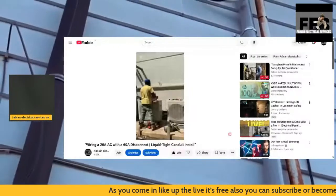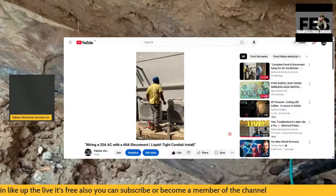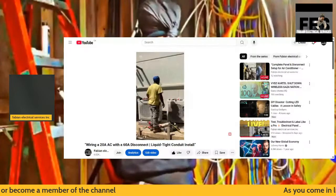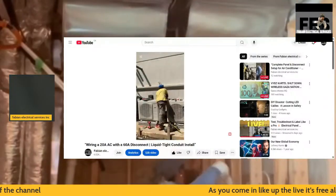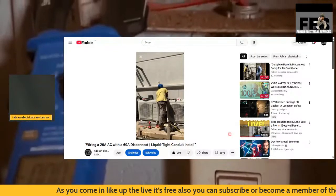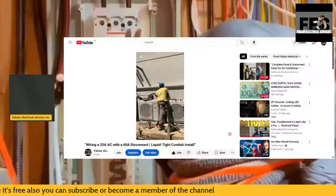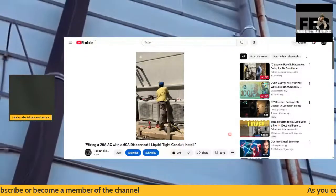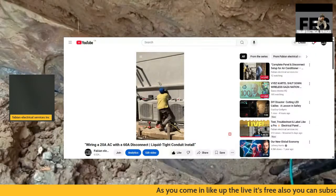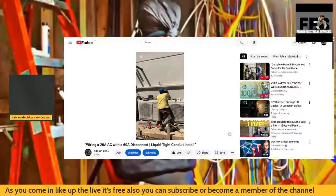I will also be using a 20 amp 2 pole breaker. I'll be installing conduit secondly. Once that is done, I'm going to place my disconnect onto the conduit itself using my compression connector, which is approved for outdoor, weatherproof. I will also be using my compression connectors to ensure a weather-tight seal, that's key for outdoor damp locations.